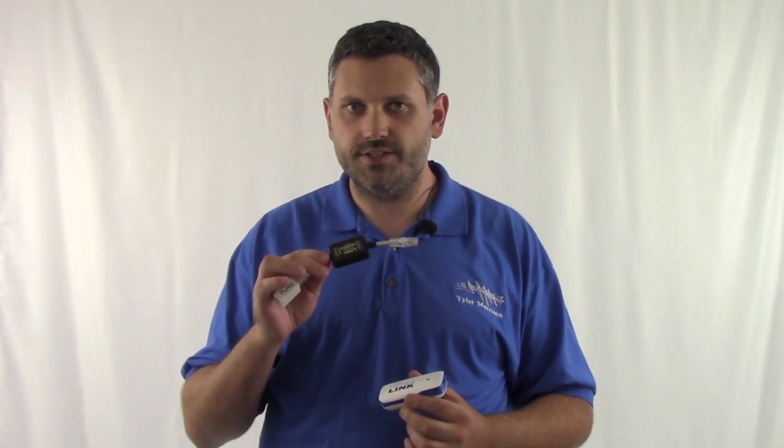Our third question is: is Cambium compatible with PowerLink? Yes, it is. You may want to consult your manual to see what your Cambium product requires. Some products require a 24-volt to 48-volt converter. Others may need a rollover crossover cable with reverse polarity. The ePMP series has reverse polarity built in; others do not.